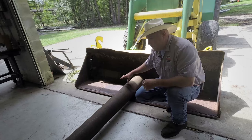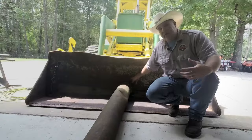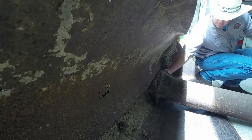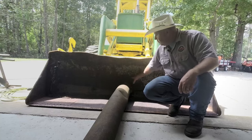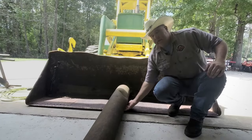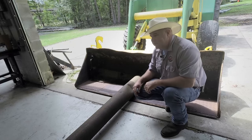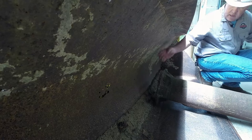I'm over here at the bucket. This is the light pole — there's a dent right here, nothing dramatic — and there's a mounting base plate that would have mounted this to the street, so I'm going to take advantage of that. I need to come up with a structure to mount into the back of the bucket. I'm going to use some wider angle iron, weld it at the top and bottom, and put a couple of holes through it for bolts. When it's unloaded I want the pole to sit without any pressure against the side to cause it to dimple or crease — I want the cables to take almost all of the stress. I do have some turnbuckles so I can adjust as necessary.